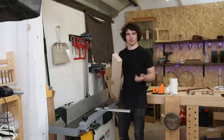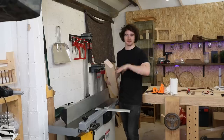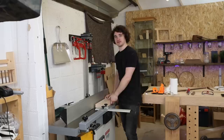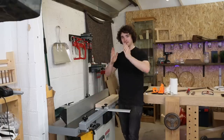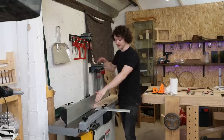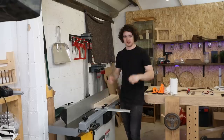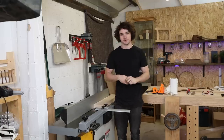The one unpredictable thing to watch out for is if you're planing thin material and the cutter block is too aggressive — the material can snap. I've never had it happen, but always be aware. If you're pressing your hand over the timber when it snaps, the next thing hitting the cutter block is your hand. If you're purposely keeping your hand away from the cutter block, you're very unlikely to get caught. Respect the machine, keep it well guarded, keep it sharp, orient your timber correctly, and you'll be laughing. Hope you found this useful — see you in the next one.